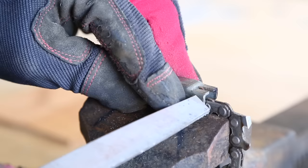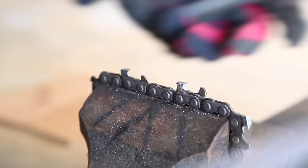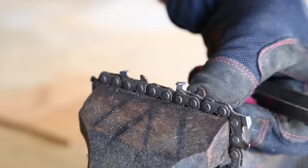So what you do is take a look at it, take it off, and file a little bit nice and flat, straight across — same as the other teeth. You have to file the raker tooth in the same direction that you filed the cutter, because if you don't, it'll chatter. So we file it down like that, put the gauge back on, take another look — maybe a stroke or two more — take a look: perfect. Now that tooth is nice and flat on top, but it's got a little corner on the very front of it, so we take our file and round that little corner off without affecting the height and without touching the cutter. Once all those rakers have been done like that, the chain is ready to install.